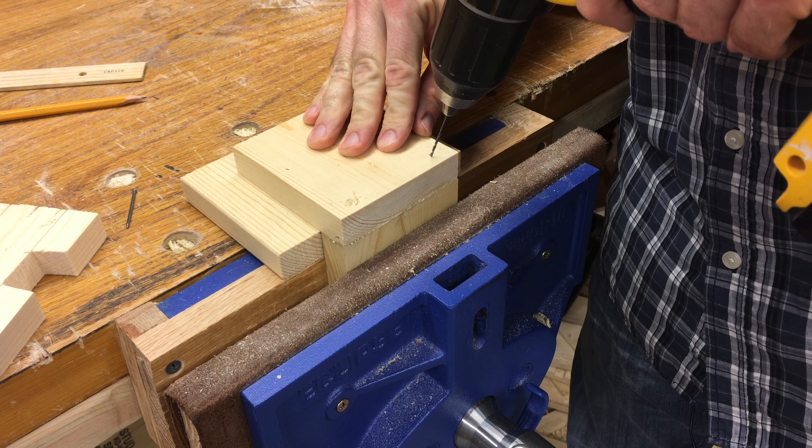I actually drove this one down pretty far, which made an indention in the wood — that's a mistake you don't want to make. I stopped just short on the other one because I want to use the nail set. You put the tip right on the head of the nail and it lets you drive it just below the surface without marring the wood. In this case I drove it too far and marred the wood — a nail set is really nice for not marring your wood. I'll go ahead and drive it in now with this.